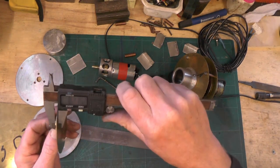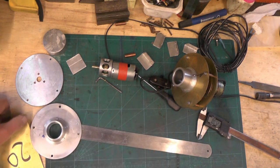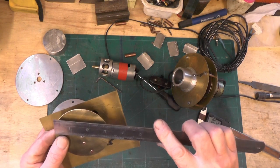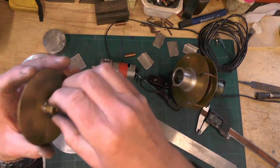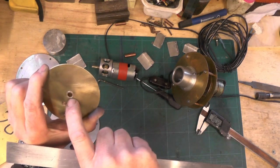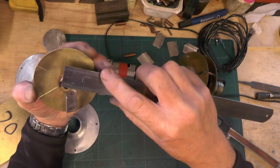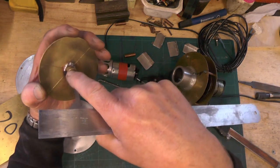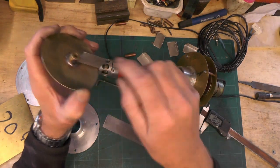The impeller is made from a piece of 20 gauge brass, approximately 1/32 inch thick. I've cut a circle out of that brass — it's approximately 3 and 1/4 inches. I've put a 3/8 inch hole in the centre of the plate for a little boss that I've soft soldered in. I've made a little brass boss with a 3/8 inch spigot on it that just protrudes through the back of the plate for the solder to run round. It's 7/16 inch long, half inch diameter, with a quarter inch hole for the motor shaft, and a 3/16 inch BSW grub screw to attach it to the motor.